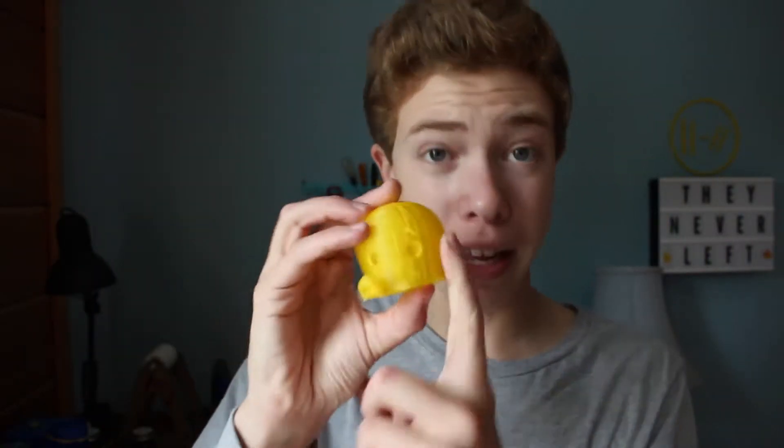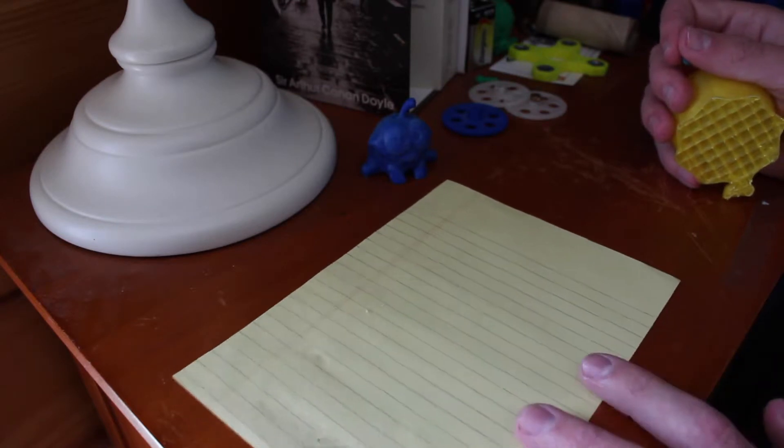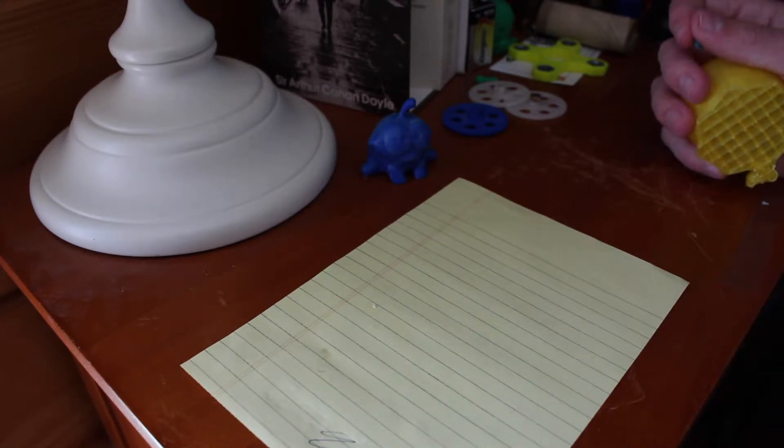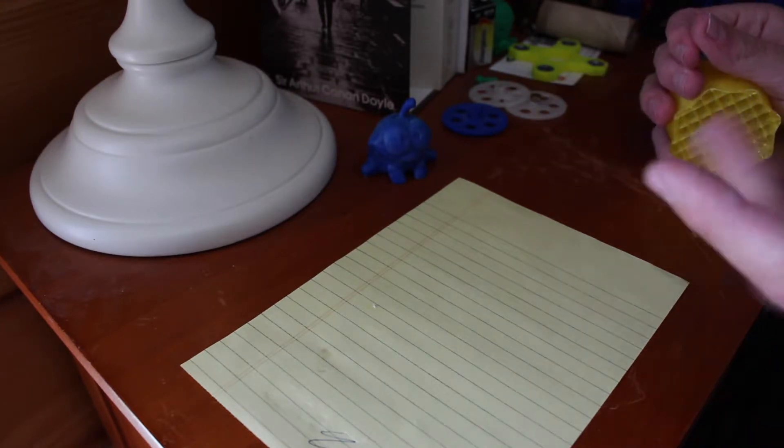Now for aspect number three: smoothing. I've actually already done quite a bit of testing with the smoothing capabilities and I've been pretty impressed. This is a model called Brain Slug — I put the link in the description. I broke off one of its antennas, but it was just a test. I used 3D Gloop on it to smooth it and it worked really well. To show you the smoothing aspect, I'm going to use it on a failed ABS print. I'll just put it on a piece of paper to work on, because while it isn't super damaging, it does get sticky — if you get it on something, let it dry and it'll peel off pretty easily.